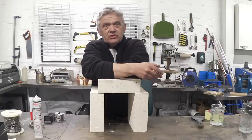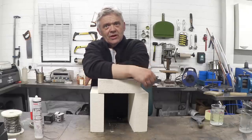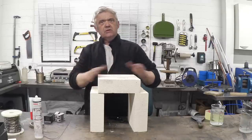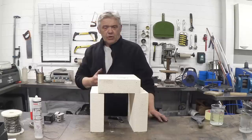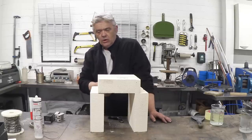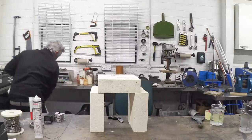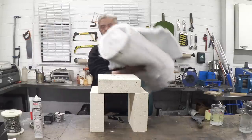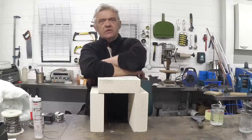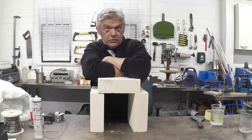The kiln breaks down into three parts: there's the kiln body, which is what we're basically going to make from these bricks; there's your electronics; and then there's the enclosure. For the body you need these bricks because they're quite soft in themselves but hard enough to stand the abuse we're going to put them to, but they're not themselves enough insulation. You also need some ceramic blanket, and when we add that around there we get a beautifully insulated kiln that's hard enough to put things in and out of and strong enough to support the heating structure.